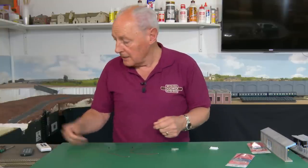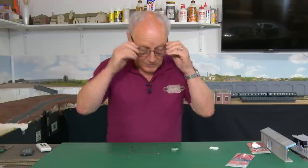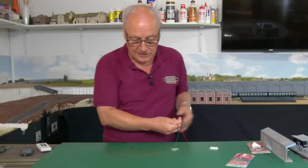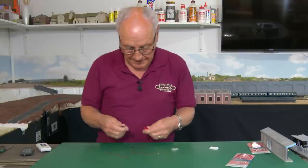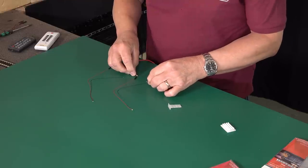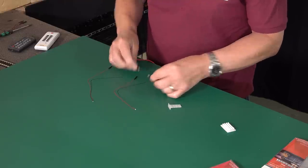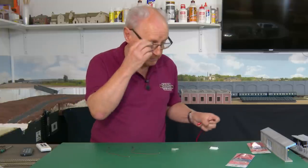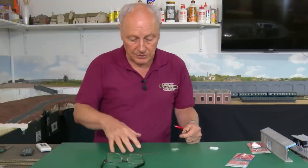Now the image on the website might seem a bit Mickey Mouse, but if you're not used to doing this sort of thing it's quite helpful. What our friend Jeremy didn't mention, which I would like to do first, is actually test the LEDs — because there's absolutely no point in assembling it all, gluing it all up, and finding it doesn't work. Yep, that one works, and yep, that one works. Which makes perfect sense really because you don't want to glue in a duff LED. So we're good to go with these two.